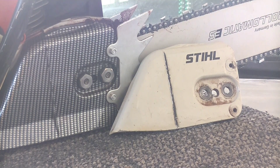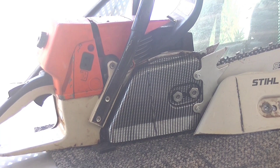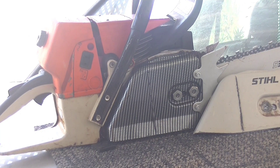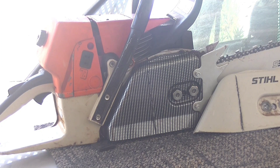I have nothing against double dogs — it's just that in my opinion I think my 066 looks a little bit better without that outer dog when it's not spooky season. Apart from all that, guys, I don't know what more could be said about this thing. It has been a damn good chainsaw with that 99cc big bore, pop-up piston, Caber rings, and advanced timing — which I forgot to mention earlier. I'm very happy with this purchase. It was well worth the $900 that I paid.